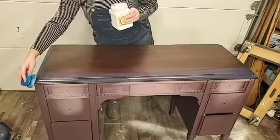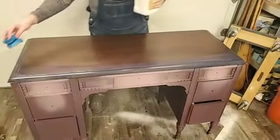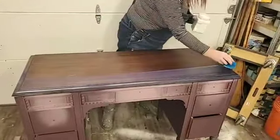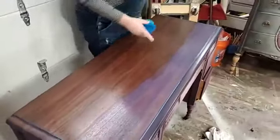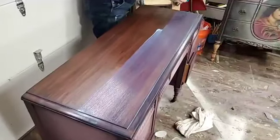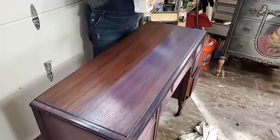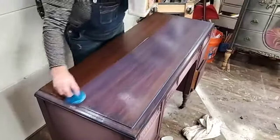Okay, I'm going to go ahead and wipe on these edges right here, and then I'm going to come in and do the center. And the whole time I'm making sure that on all my passes, I don't have areas that are gummed up. So that looks really clean. And then I'm going to refill my sponge, and I'm going to come on and wipe it on. And I'll wipe back over it because I want to make sure that I don't have a streaky application. There we go. If your clear coat is streaky going on, it's going to look streaky when it dries. So I will come back and put Gator Hide over the top of this, but I'm sealing this raw wood with my satin clear first. That way when I put my Gator Hide on, I'm not trying to put on a product that sets up really quick over a porous surface. It'll be a sealed surface and it makes the Gator Hide easier to apply.